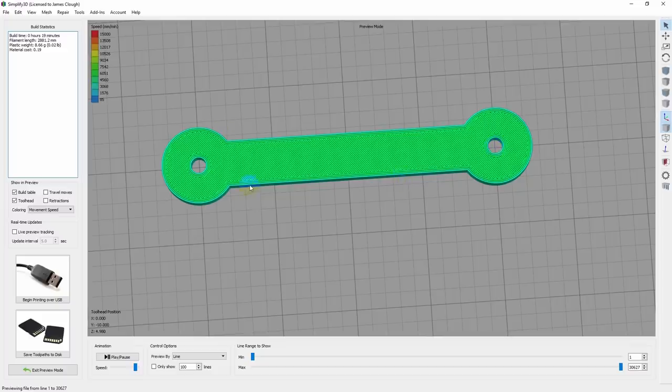So if I had a situation where there was something going on the perimeter walls where I was either over or under extruding and I needed to adjust the walls in or out a little bit, the horizontal size compensation would be appropriate for that. But if I'm trying to compensate for shrinkage, like my part is the wrong length overall and has complex features, then the horizontal size compensation is not what I'm looking for.